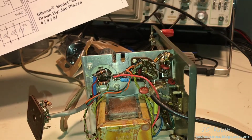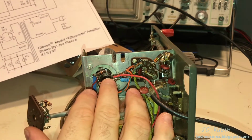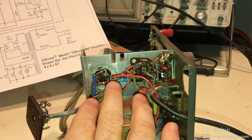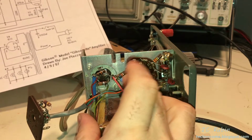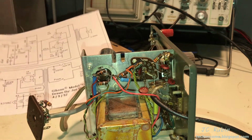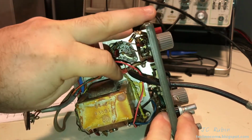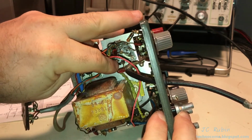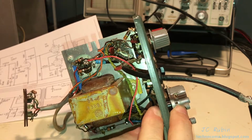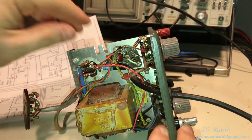So what I'm saying is I'm not worried about these voltages being excessive, because I know the voltage is not going to exceed anything. The B plus coming off of here, right here, after this cable, this all needs to be clipped out in its entirety. And then it makes its way to this coupling capacitor. That's my demarcation point. Clip that off, and everything on here is the power amp, the beam power tube, and everything on here is the preamp. All this garbage has to come out. This is just fiction, right?